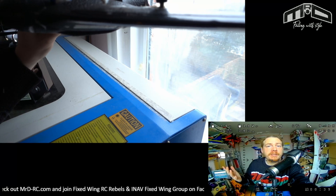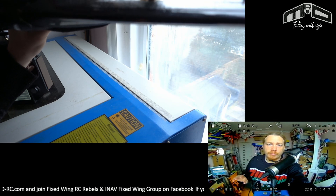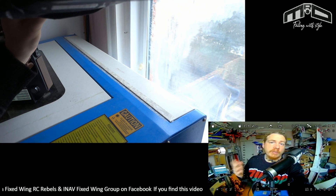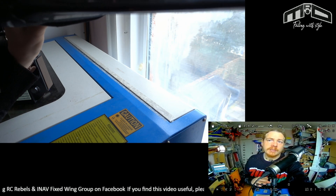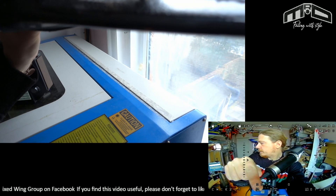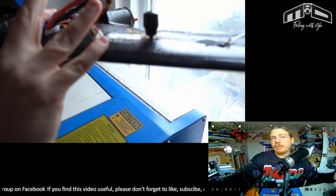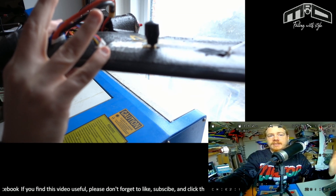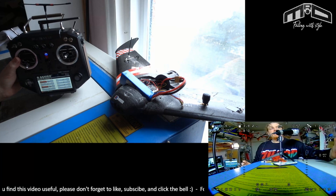We're back. What I've done now is set the CLI — I've turned the disarm kill switch to on, so if I flick the arm switch it will disarm no matter what. I've also made sure that the extra safety arming is set to allow bypass, so on the bench I can do the arming switch and test things, but in most normal circumstances it's as if extra safety arming is turned on. I've added the programming, and you can see this G0 and zero — that is a global variable. When I flick the switch to simulate the flight, in the programming that will change to one, which means extra safety arming is disabled, and zero means it's off — so it's as if it's normal on the bench.